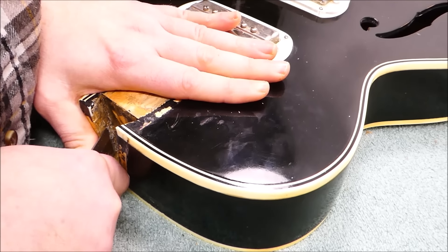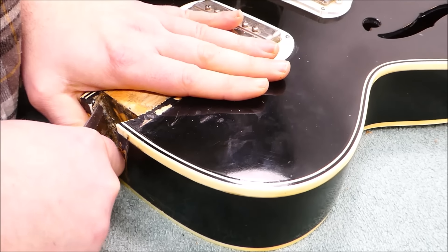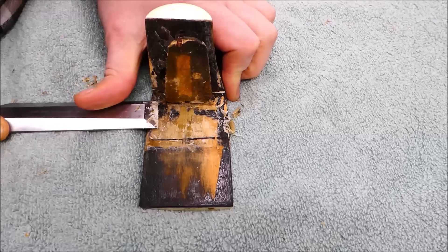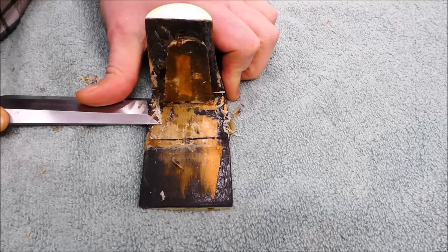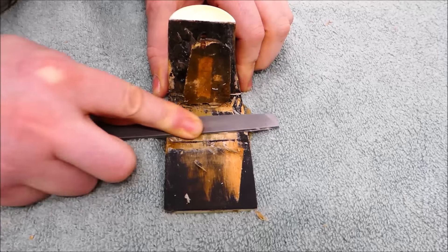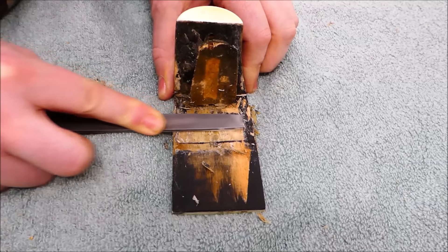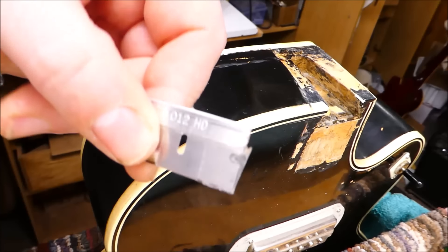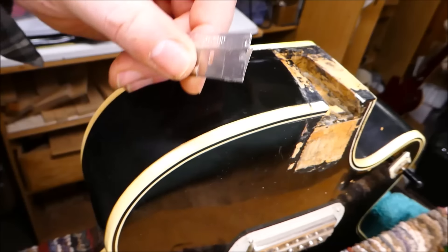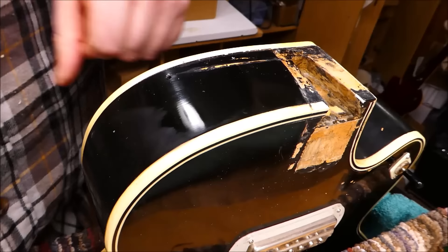Back to the Silvertone — there's a whole lot of glue to clean out of the neck pocket. I think they were relying on it more than the actual fit of the parts to keep things together. The area of the extension wedge doesn't seem like it was ever seriously prepped to fit the soundboard, so I decided to make it reasonably flat to give me a bit of a head start when shimming it. I'll put the body in my padded cradle to start addressing the side crack. There's a real hump of glue, so I'll scrape it down with a razor blade, the corners protected with tape.